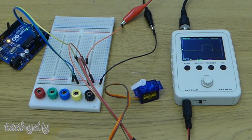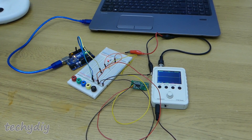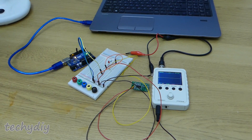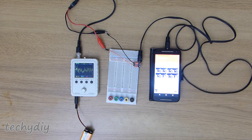Let's have a quick look at some of the things we can do with it. This is an Arduino controlling a servo, sweeping it backwards and forwards — the scope is monitoring the output pulse to the servo, and the width of the pulse determines the servo's position. This is a microwave motion detector whose output goes high when it detects movement and the red LED turns on. We're monitoring the output of the module with the scope; the trigger is set to single and rising edge so that we can capture the waveform as it turns on. And then this is the scope monitoring the output of a phone playing music.